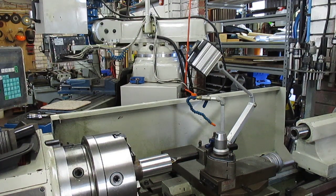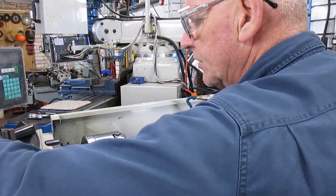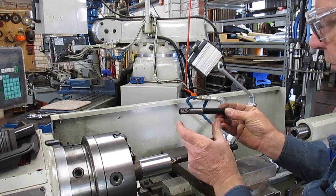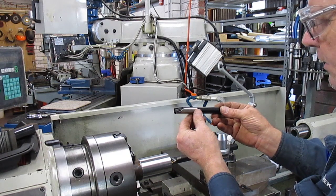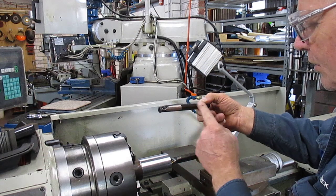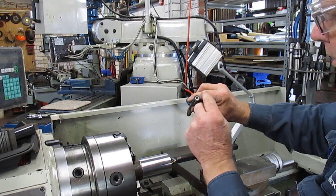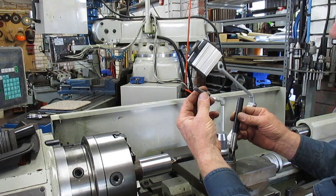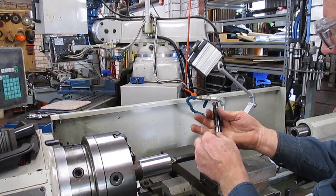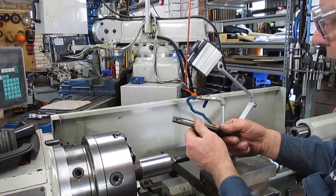The ways of overcoming that vary. For this small bar here, I had to cut an Acme thread very deep, so I've ground that off a bit. For a second job that was very deep, I needed to go in that depth, but I was over the slenderness ratio. So what I did was drill a hole through it and loaded it up with old carbide milling heads — I cut them off with a diamond cutter and stacked them inside. That gives it extra weight. The Allen bolt and grub screw have been tightened up, and that solved the problem.